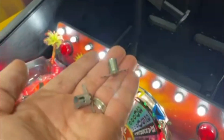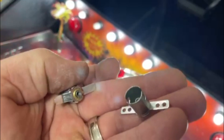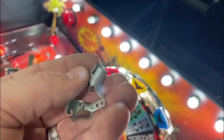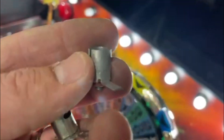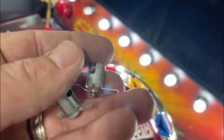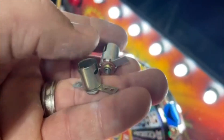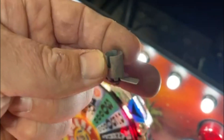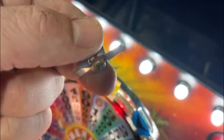There are two different kinds of lamp sockets that they use back here, and they're just pressed together, so everything makes contact through the middle. There are a couple different styles. Like this one in particular, this piece right here that I'm touching is actually attached to the body. Whereas on this other one, it's not attached, but pressed in making contact. The one in this game in particular is this one here, so I don't have to worry about this end. But I do have to worry about the spring right there that goes all the way through and makes contact with the bottom of the lamp.